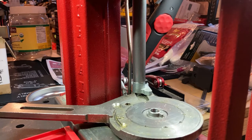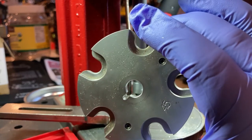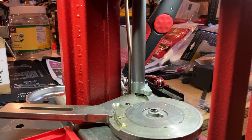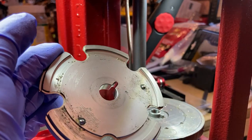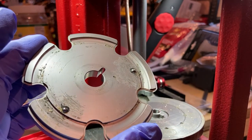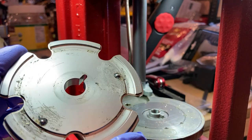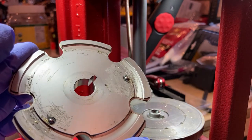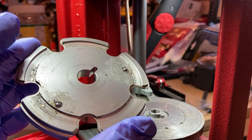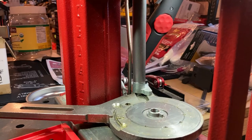With the shell plate, you can see it's pretty dirty — it's got little brass specks on it. Underneath, we've got a bit of grease, debris, and stuff that builds up in there — just general residue, maybe a little bit of powder mixed in with everything. If you don't remove these and clean them over time, they're just going to build up with crud. So we're going to take that and clean it.